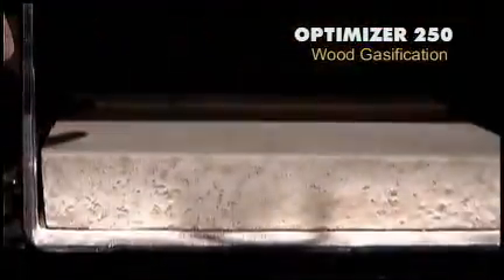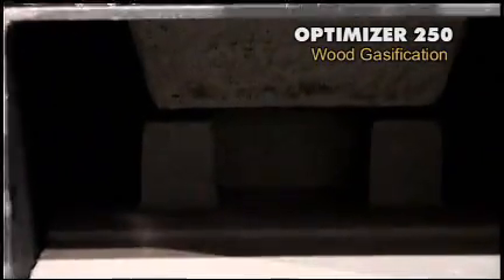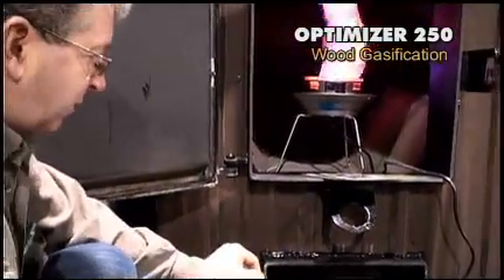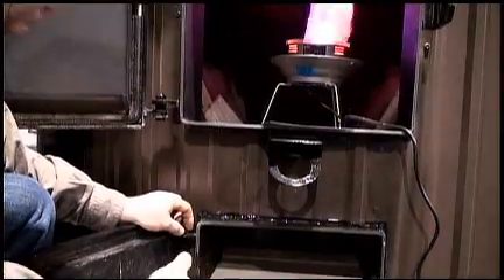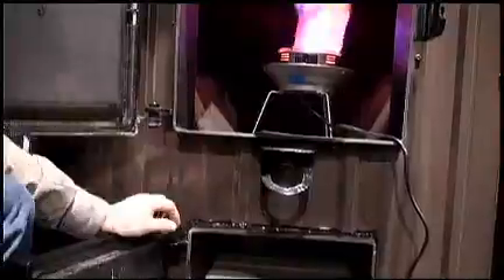Down in the bottom of the chamber we have a lot of refractory brick. We have a nozzle that directs into a target area — the target area is a U-shape that makes the smoke come around to the front of the stove. We're water-cooled on both sides, so the smoke and fire come to the front and then go to the back, giving off heat into the water on both sides.